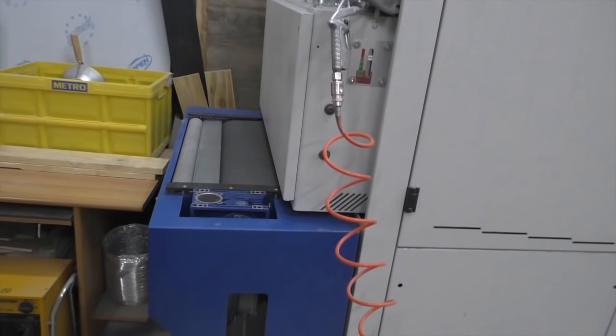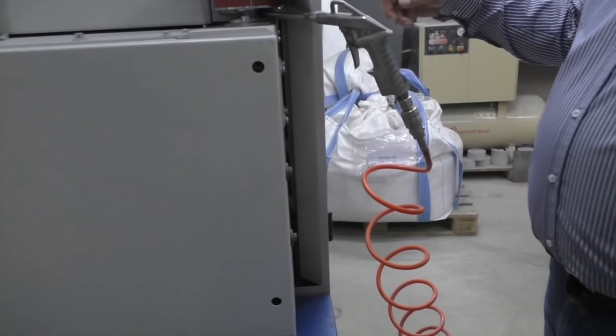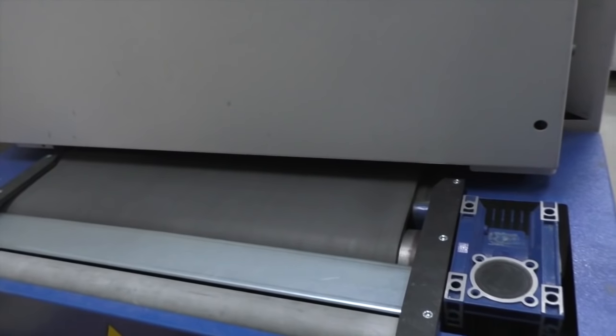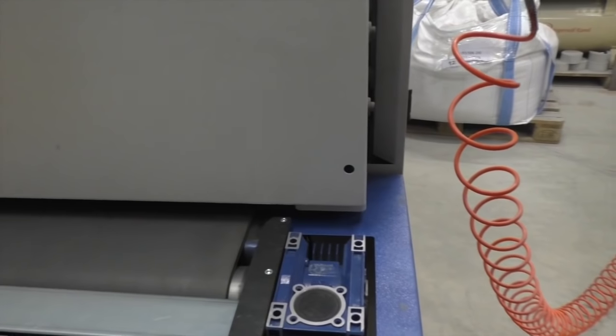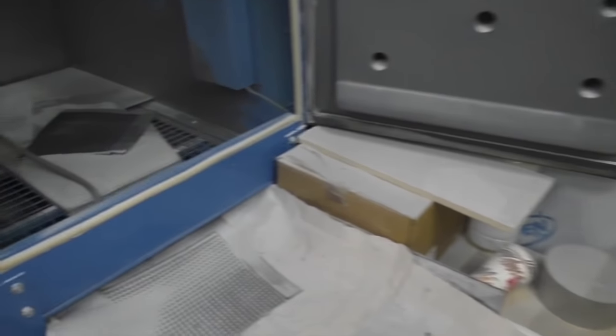And this is a flat grinder, so that you can get the panels that are cut. They go through this machine, which has two grinding belts and a brush on the back to give you the finish on the flat panels. After it's cut, it goes here to get the brushed finish. And a bead blasting for cleaning the smaller parts. Right. Getting the satin finish on the front panels.